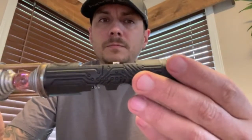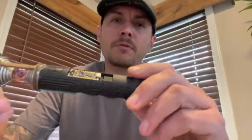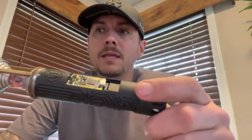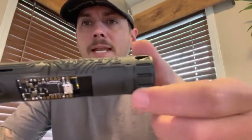It was my original intention to put a small LED strip to light up the little gap in your sleeve. I went through about seven or eight different LED strips I bought off AliExpress — I liked them because they're super tiny, but they don't act right when you cut them. It's a 10-pixel strip and I only needed five; every time I cut it where I needed to, the thing just quit working. I fought with those for over two hours before I decided it was probably not a good idea.